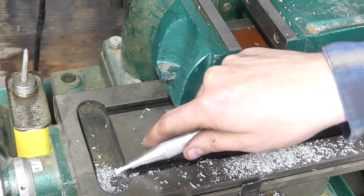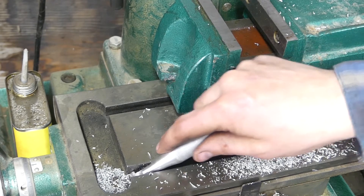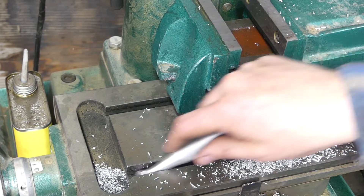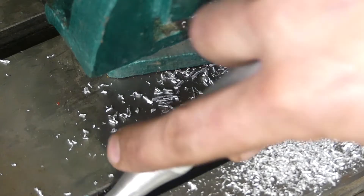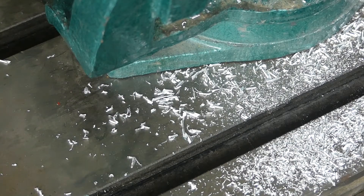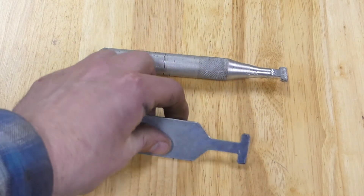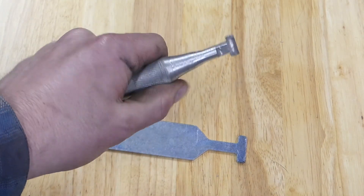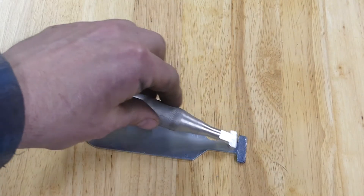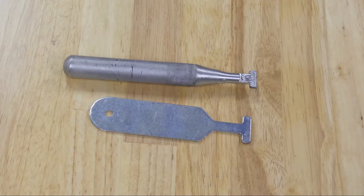This is just testing it out and it works pretty good. Once I get the stuff to the side, I just vacuum it up — the stuff with the oil on the bottom sticks to that oil and the vacuum just doesn't quite suck it up. You can see there's some stuff in the bottom that's probably Cosmoline from shipping from China — it's never been cleaned out, and this does a pretty good job. Compared to the commercial one you could buy made out of metal, this is an aluminum one I made so it wouldn't scratch anything. It feels nice and seems like aluminum does a good job. You can see the width difference from the Bridgeport's to the little Chinese one. Thanks for watching. Bye.